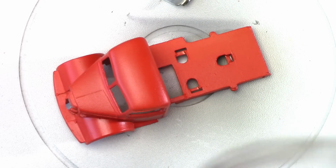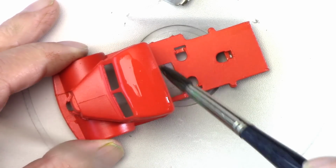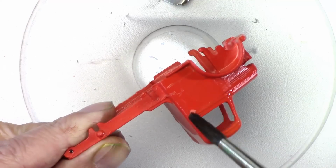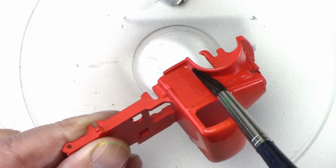The next morning I have started varnishing. I apply Johnson's Clear with a soft brush. During the course of the day I will apply another coat, maybe more, until I am happy with the finish. Being acrylic, it will dry quickly enough to finish varnishing on the same day.